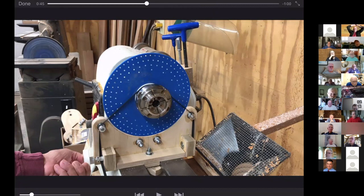for these bearings, they're technically 8 millimeter ID, 22 millimeter OD. I'll confess I did buy a 22 millimeter Forstner bit. I'll be happy to lend it out to anybody. Its only use that I had was for doing this. But I do have it on hand if anybody would care to go this route versus going with all English dimensions and using a 3/4 bit or whatever.